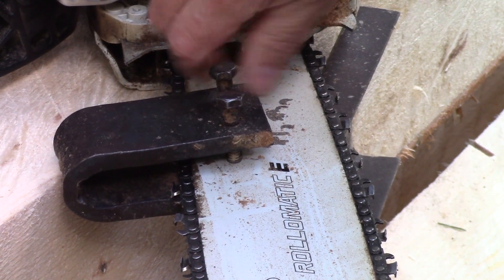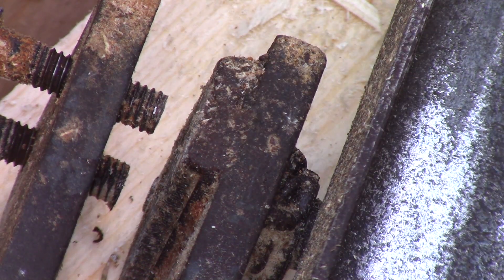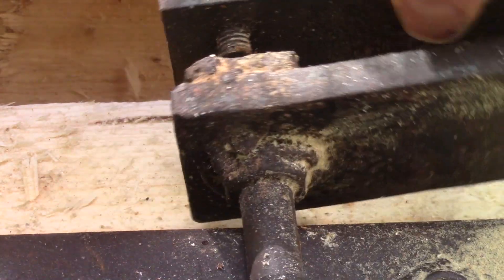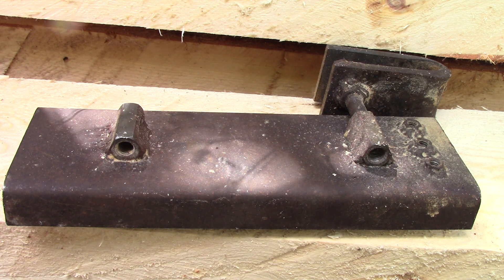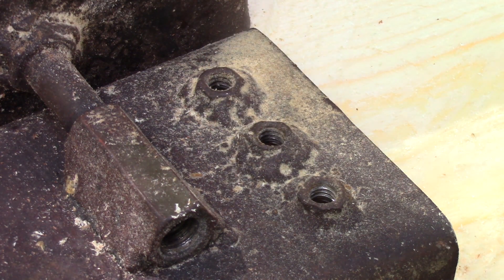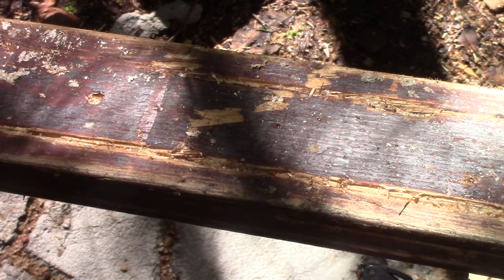I always tighten one screw super tight and the other one just a bit — just enough so it won't move. I welded a piece of file inside one side. On the other side, it's just two threaded holes for some bolts. There's a bolt welded on the other side of the file — this is the pivot of the jig. On the base, you can see that I've welded two nuts, but I only use one of them. I welded two because I was afraid the weld would break, but that never happened. I also drilled and welded three nuts for some gripping bolts, but I lost all of them and don't have any left at the cottage. It's supposed to block the jig when cutting, but as you saw, it's working even without them.